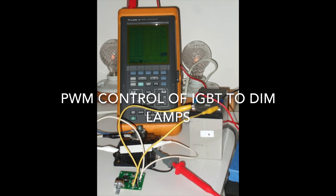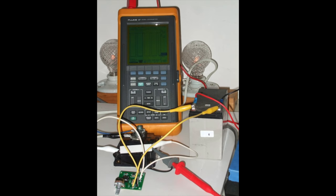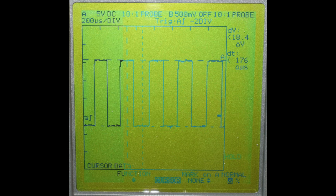I disconnect the pot, turn the voltage up, and give it a pulse — it turns on and stays on. I can turn the pot back off and as soon as I flip this the light turns off. After mastering switching the IGBT on and off, the next step was to pulse-width modulate the IGBT to dim a lamp, and the next step was to probe the VFD and find the pins that were triggering the IGBTs to make the modified sine wave.